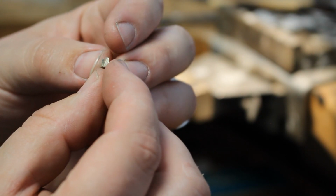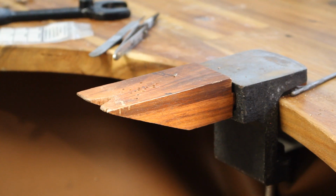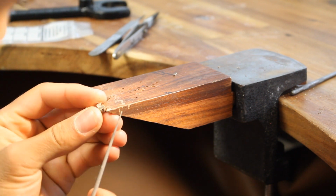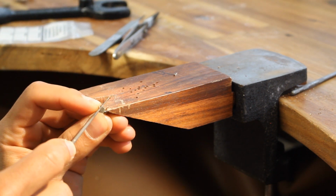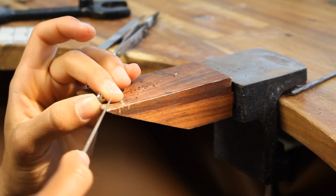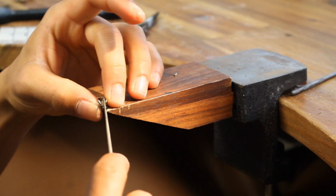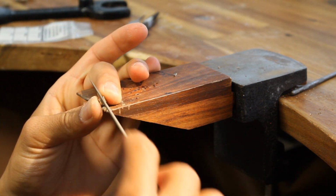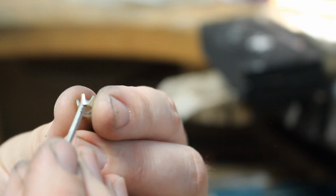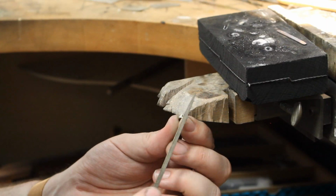So we've got this all roughed out with the saw. What we're going to do now is take a round or a rat's tail file, is this, and tidy up in between each. And it's best to do one, miss one out, do another one. Cool, so now Emil's done the scoops on this and all the scallops, we're going to put a little V shape in the bottom of there using a three-square file, that's called a tri-square.